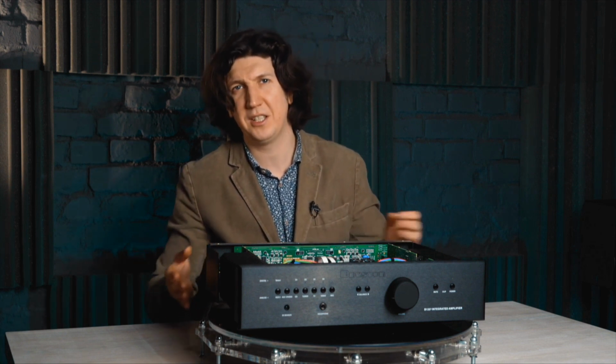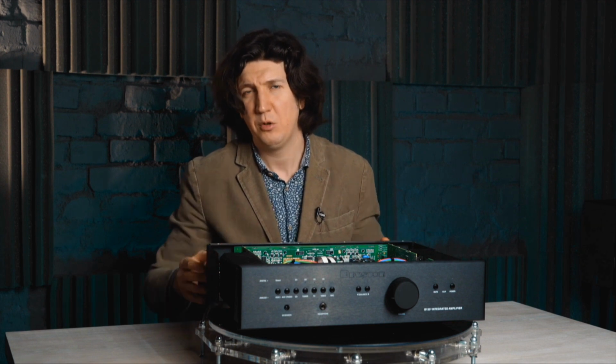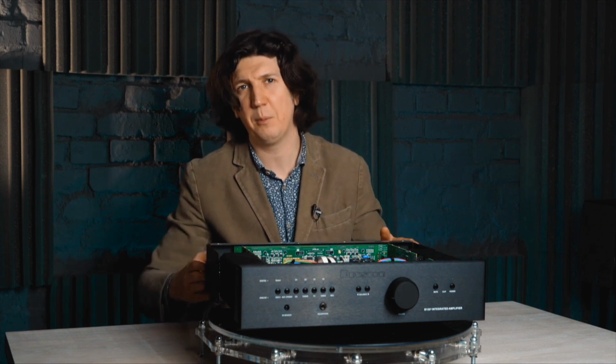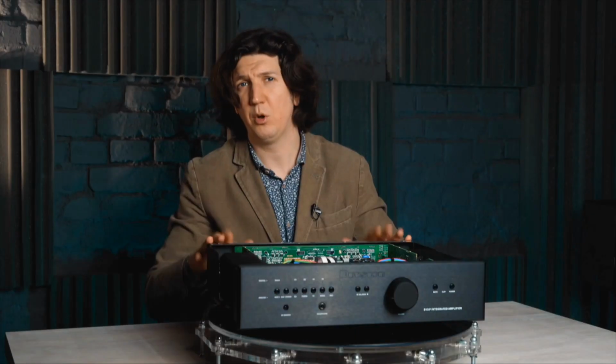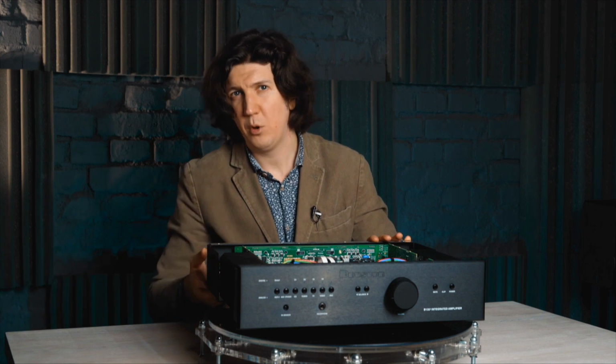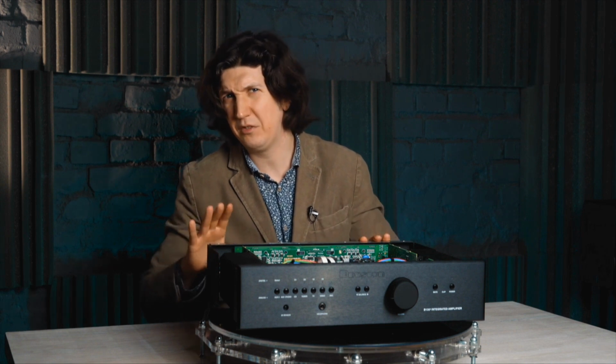Therefore, if you bought Bryston or you listen to it somewhere quickly, they want to show you in the salon, unheated, taking it out of the box, or when it was standing, well, it's better not to listen because it will not reveal its full potential. It needs to be warm. Even if you turn it off at night after listening to it, instead of putting it in standby mode. By the way, in standby it consumes about 70 watts. So you slept, turned it on in the morning, and it still doesn't work. More precisely, it plays but not cool. It needs about 20 to 15 minutes to warm up exactly somewhere. So we turn on in the morning, go drink coffee, tea. Only after that, Bryston gives out its signature cool sound.